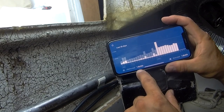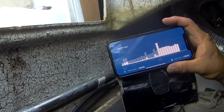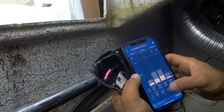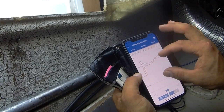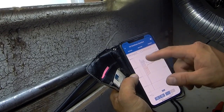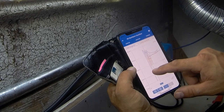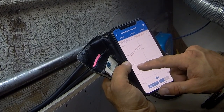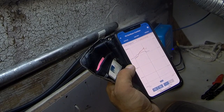The panels have generated 14 kilowatt hours in total — and it's not quite a month yet. These 400 watts of panels seem to be doing a pretty good thing. In this trend view you can take a look at what's going on — the solar current, and you can see when I got them plugged back in, the voltage went from nothing to about 70-some volts. You can drag the graph around and analyze what's actually happening, and see the current is up at 0.8 amps charging.